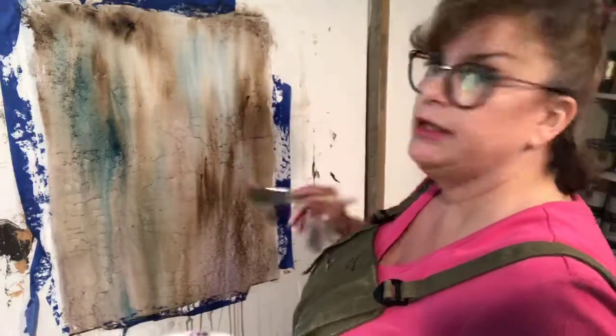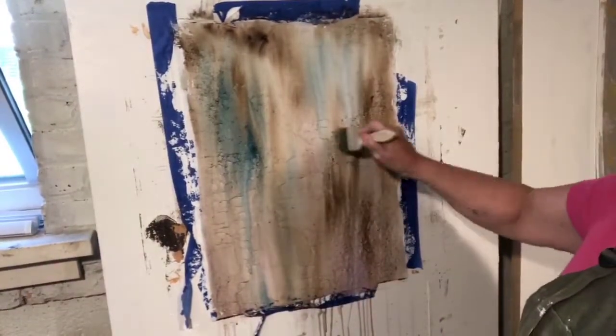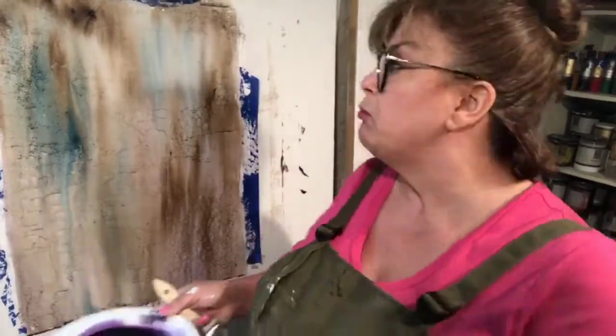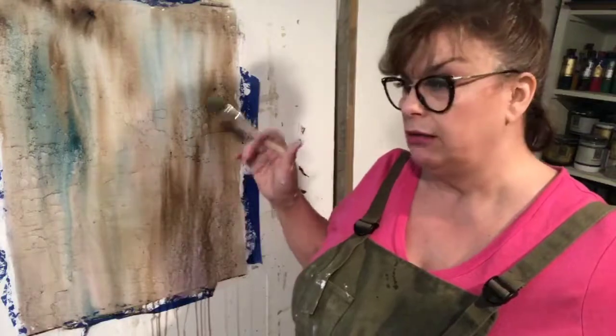This is coming to be a very pretty finish. On a job I could come back and put more in once things dry a little. When you're working on furniture or a wall with this, let it dry and see where everything sits, then come back and add more. Faux Cream Colors have acrylic in them, so they're bonded — they're not going to wash off once dry.